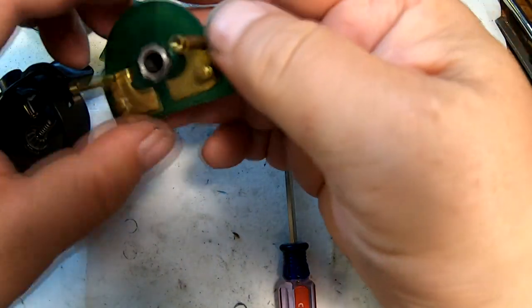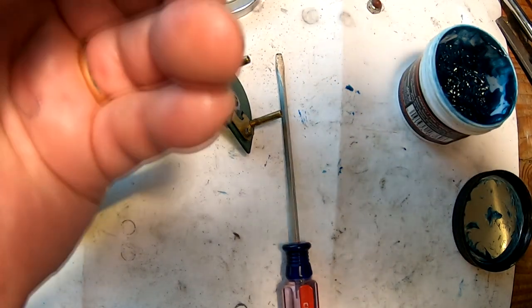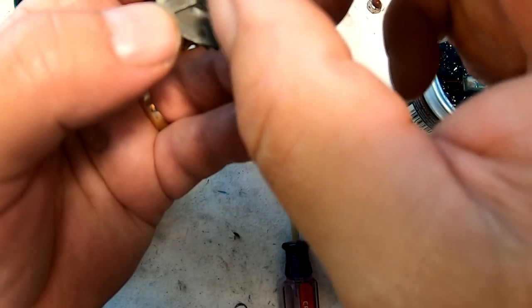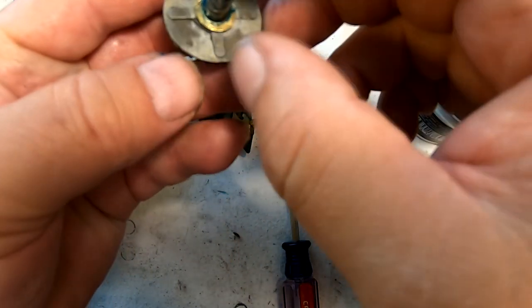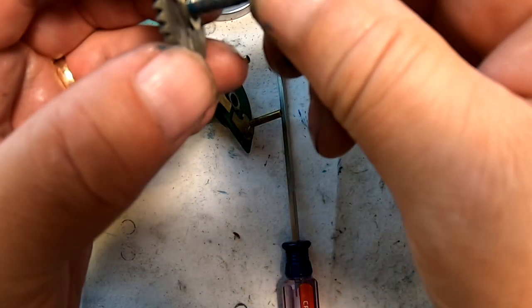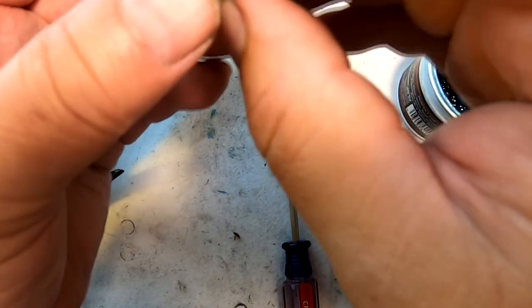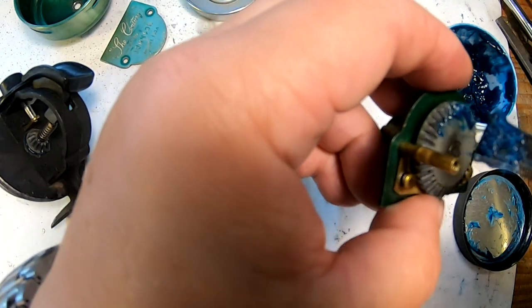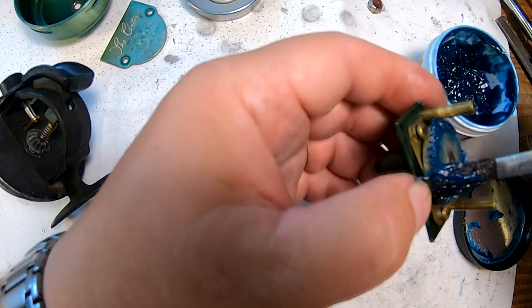Here's the main handle gear. I'll put some grease on there. One thing I noticed is the gear was not engaging, so I took a small brass washer — actually a grommet — flattened it down, cut it to the right size, and made it so that this would close the gear lash so it works better. Put that in there, lube this up, and lube this gear here. You don't need a whole lot — when I turn the handle, that will lube the other gear that's in there.